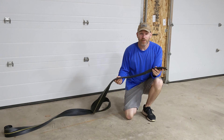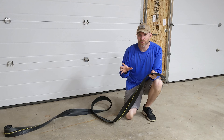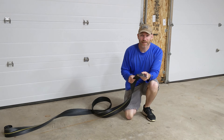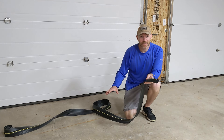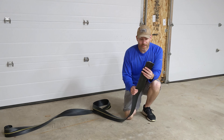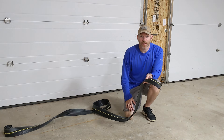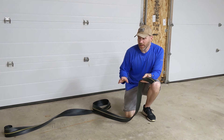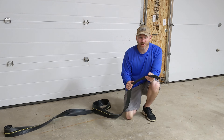This is simple, effective, and cheap. It's about $30 to $40 on Amazon for about 12 feet. Essentially, it's just a ridge of rubber, about a half inch in the middle. You use construction adhesive to stick it down to the concrete, and that just seals out the water. I used it on my old shed and it completely stopped the leak under the garage door, so I went with the same thing.